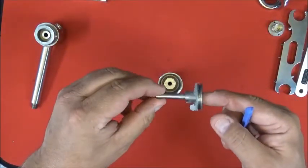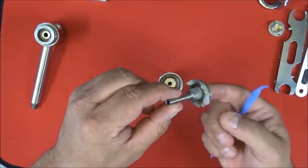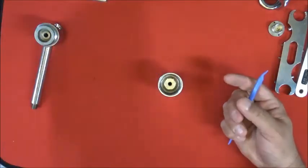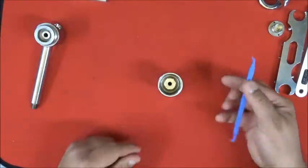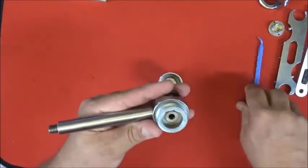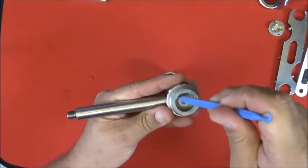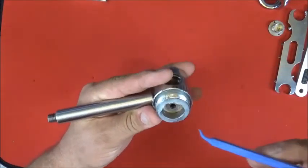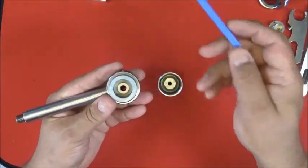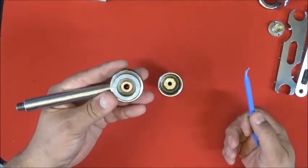The piston is a crucial part of these regulators — they're very scarce, so you've got to treat this one like a porcelain Jesus. Set it aside and don't mix it up with anything when you're cleaning it. On the underside where we pulled the piston out, look to see if there is a spacer in that area — sometimes they're translucent and hard to see. If there is a spacer, set it aside making note of whether it's on the shaft of the piston or on top of the spring.